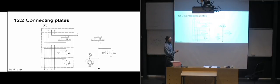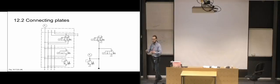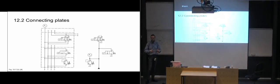We also have a different valve, which is solenoid actuated, which releases fluid back to tank, which means that we are allowed to activate this one if we just want to circulate the fluid from pump and back to tank. For example, if we are going to close this one off, whatever we're doing up here means that there will be full pressure in the system, that the pump will basically just be pushing against the wall.